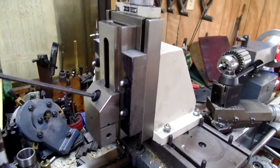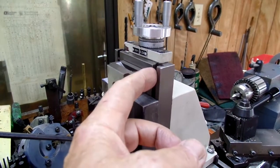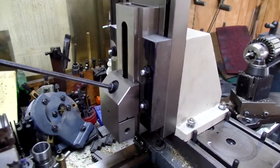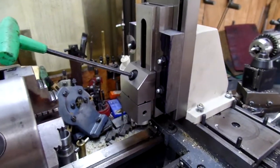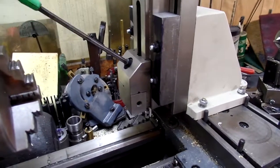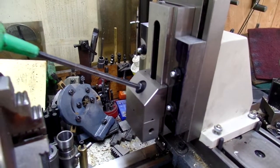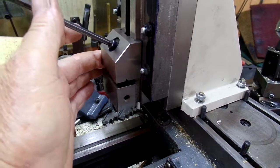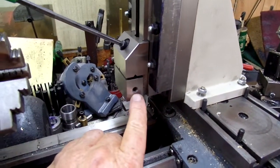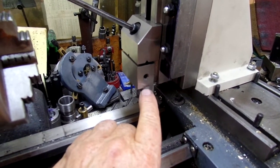I thought about modifying the milling attachment table and I made it. There are only two T-slots that take standard six-millimeter bolts. The hold downs here are 35 millimeters, and there are options I haven't followed through on. With a typical machinist vise there's a crossbar that you jump from slot to slot and you can develop quite a lot of clamping force. These are tapped holes, so you can make a vise stop quite easily for a little more precision.